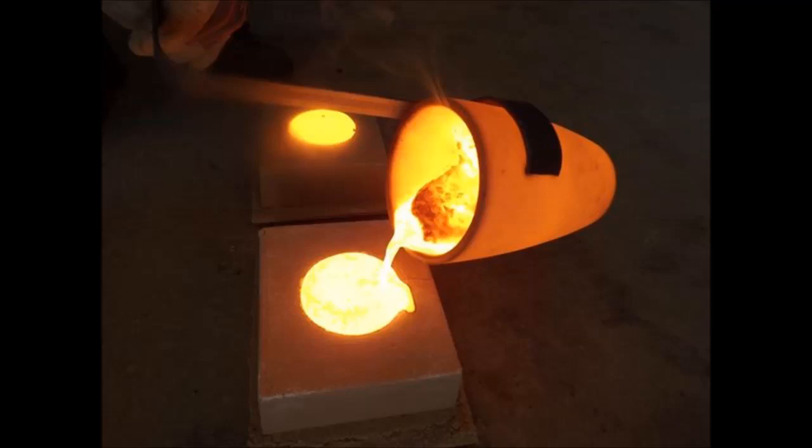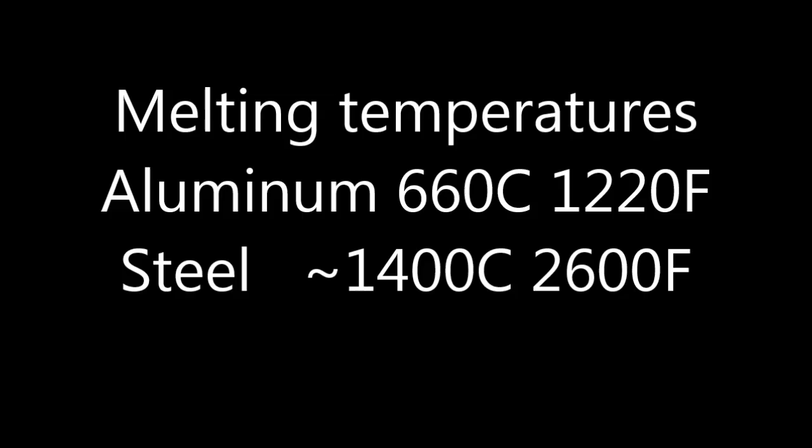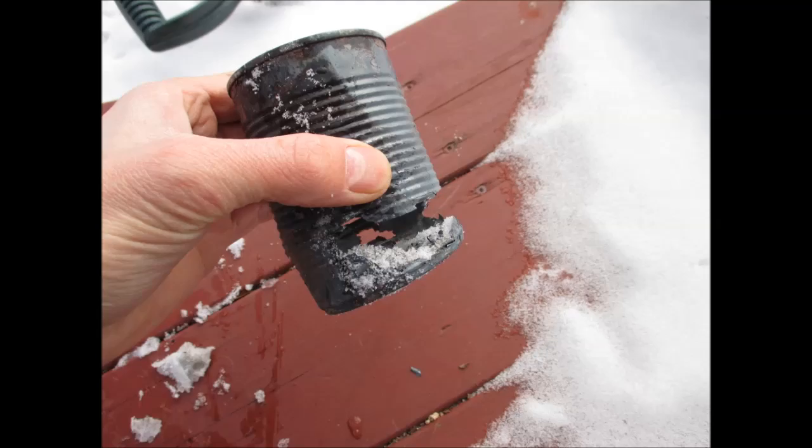The crucible is the recipient which holds the liquid metal. When melting aluminum, a steel crucible can be used, because steel melts at twice the temperature aluminum does. But don't use any metal cans — they have thin walls, rust quickly, and you'll end up with a leak. And if the leak meets water, the water is vaporized and pressurized, and you get a couple of risky exploding aluminum bubbles.